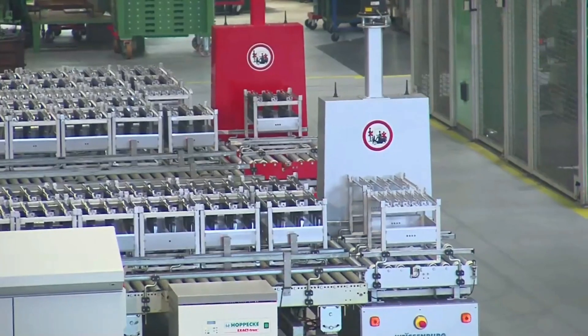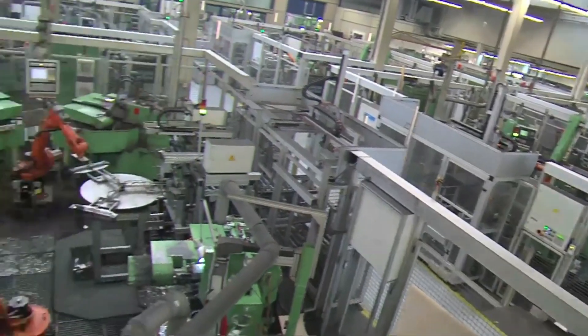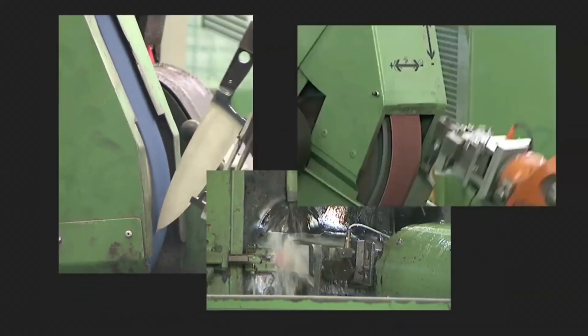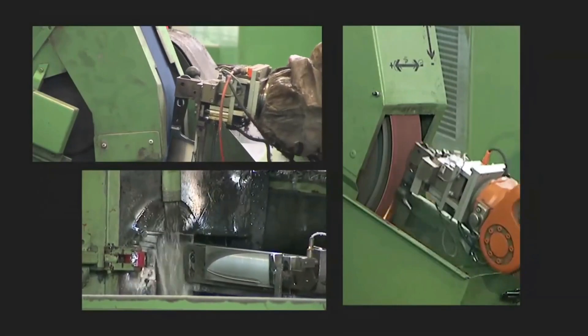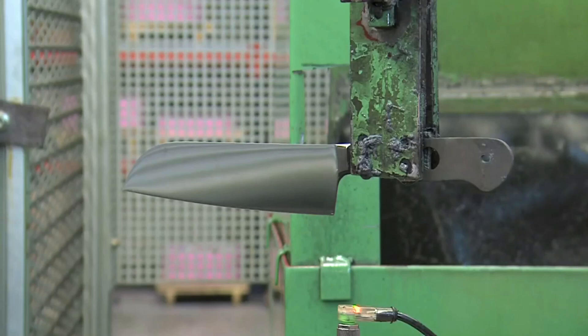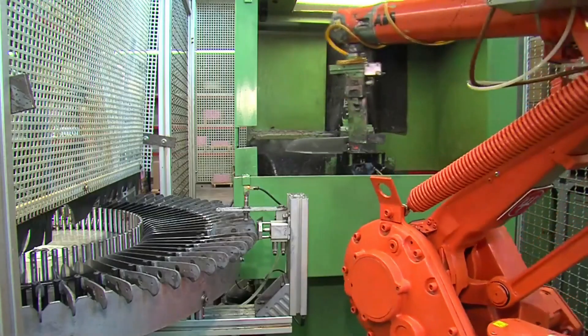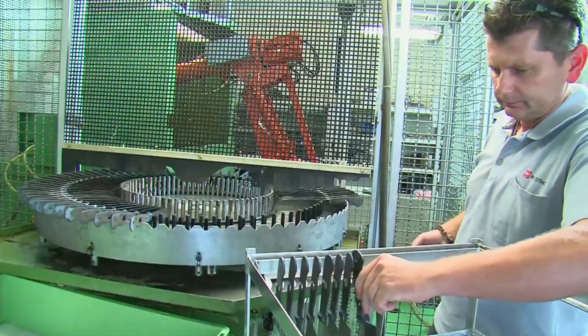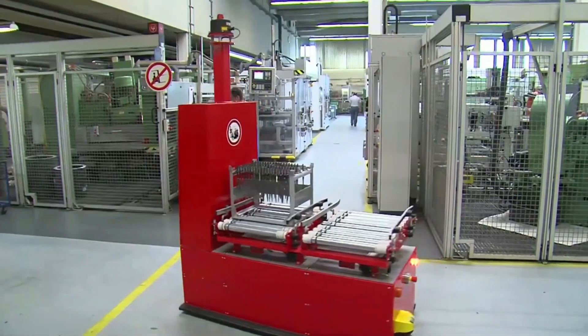The blades are now ground using the grinding machine. All transporting, loading and unloading of the individual production units takes place automatically. Firstly, the flat surface of the blade is coarsely ground by robots. Next, the blades are polished to give them their fine satin surface. Robots are also used to sharpen each hollow edge in the blade. Qualified staff constantly monitor the production process.